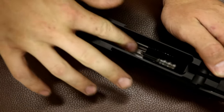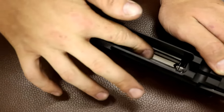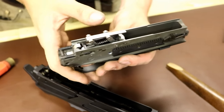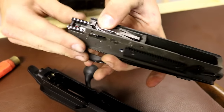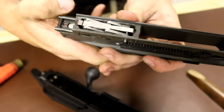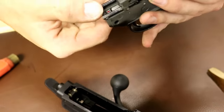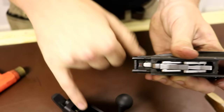It should without force sit, and you can watch it cycle and rotate into place. Make sure it's at its maximum forward position, then push the bolt handle into its maximum forward position. Push the arm back and make sure when you push the back of the mainspring cocking arm you're in a cocked position. That bridge connects with this arm, and as you push your safety catch up that actually pushes this arm forward, cocking the gun. So your mainspring pressure is borne by this, to that, to the safety catch.